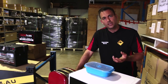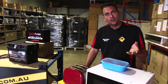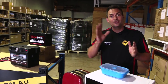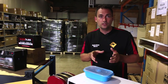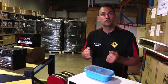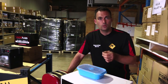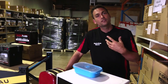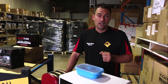When you're running an inverter, you always want to keep a bit of headroom. If you've got a 1000-watt inverter, you don't want to run it at 1000 watts all day long — it's like your car, you don't leave it at maximum RPM. I recommend 20% headroom: if a device draws 800 watts, use a 1000-watt inverter. All of our inverters have a surge output of double their rated capacity, so a 1000-watt inverter will surge up to 2000 watts for a short period, allowing motors with high startup power to run.